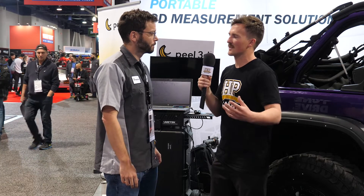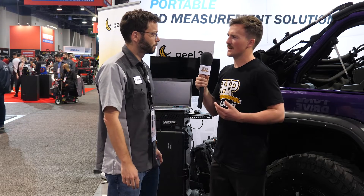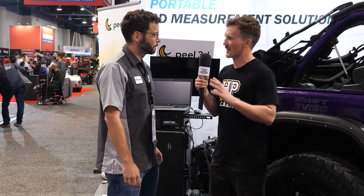On dimensional accuracy — when you take a scan of something, you need to take some measurements so that when it's in CAD or whatever software you're using, it's properly scaled. A scan is essentially a ton of measurements — everything is a measurement, so any dimension on your scan will be accurate down to the scanner's accuracy spec. A scanner like the Peel 3 will be accurate down to a few thousandths. You can extract specific measurements like cylinder diameters or point-to-point distances, or just use the scan itself as the reference for creating your design.